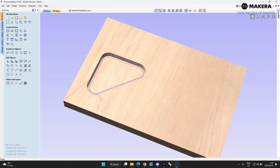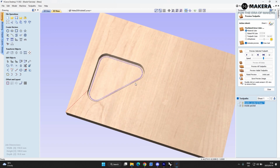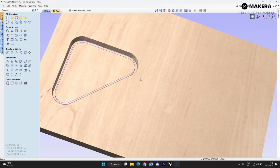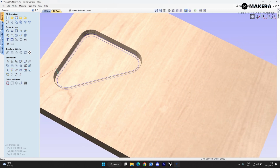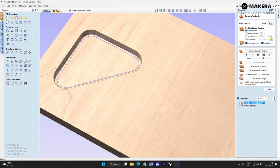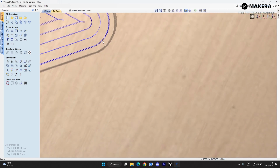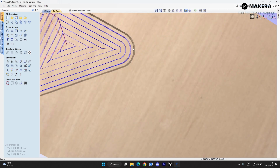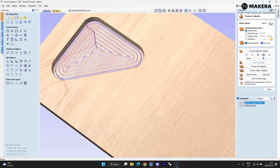So this automatically gives you a second pass on the inside pocket. The reason for this is that I've selected two tools in the previous tab. This is useful with Auto Tool Changer. If your part has small inside corners, then it will change and do a finishing pass with a different bit. You can see it's a little bit more offset the last cut. So that's going to just give you a final pass surrounding it. So let's leave it that way.